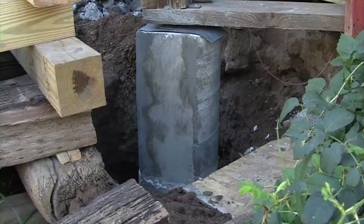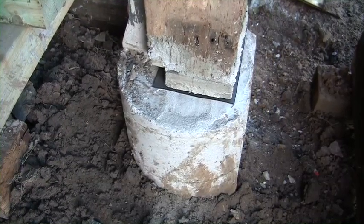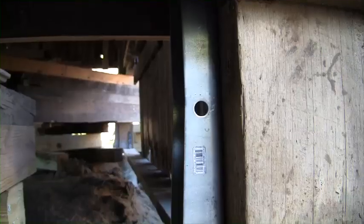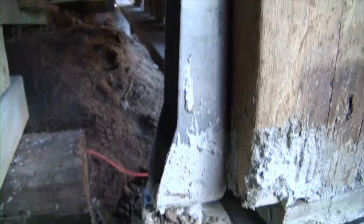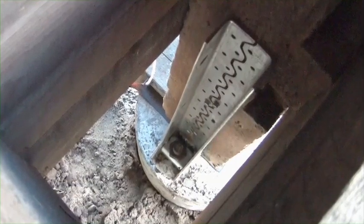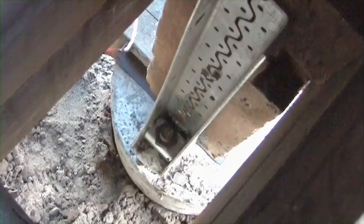The taper is necessary for transfer of load. The load comes up from the outside corners at 40 inches and load transfers at a 45-degree angle. If you came straight down with the 16-inch tube onto the 40-inch diameter base, there's a possibility under load conditions that you'd break off an edge, because the load is primarily concentrated in the center. You want to transfer your load-bearing capacity all the way to the outside edge. There is a large bracket about 20 inches up the side of the column, with a one-inch diameter rod running down into the center of the pier and into an assembly of reinforcing bar — rebar.